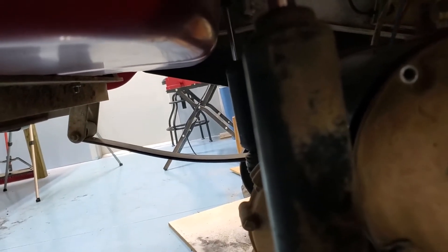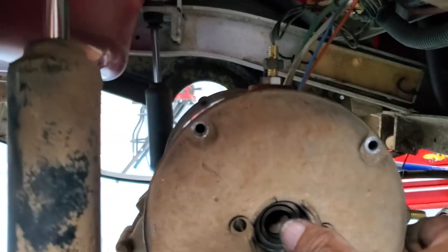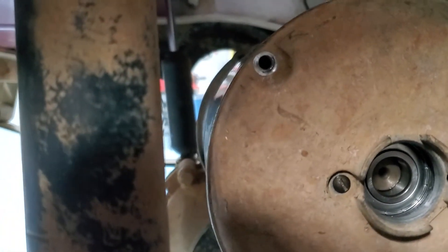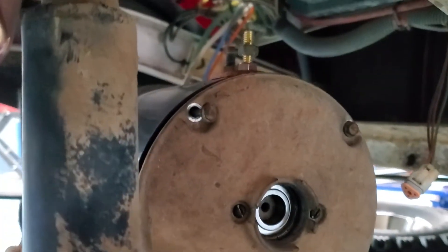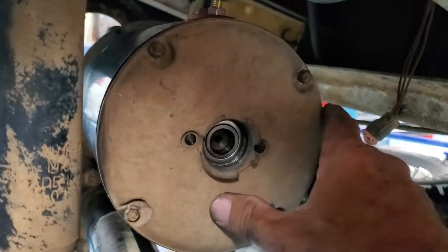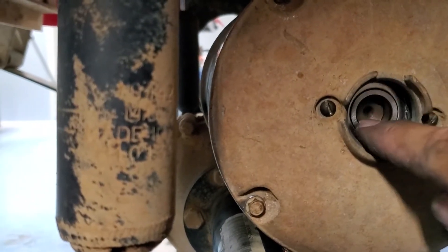I'm going to try and get the new assembly back in. First thing I've got to do is get the bolts lined up with the holes. The holes are parallel across the top, level with each other, and at the bottom. I'm already touching the end of the shaft right there, so I need to get the bolts in there. The bolts aren't quite long enough to put much pressure on the bearing, but they do keep it lined up straight because they have to go through those long holes. Now I've got to get a socket and use it to hit just on the inner race and drive it in.